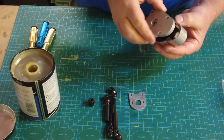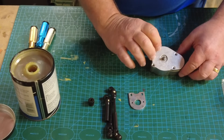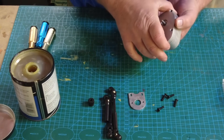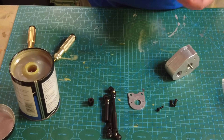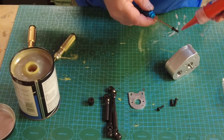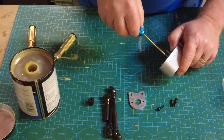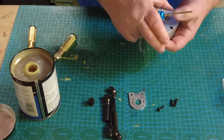I'll pop the plate back into position - there's only one way it goes on, countersunk holes on this side. This gets fixed together with countersunk fixings from the option pack bag. I'm going to put thread locker on these because I don't want them coming undone. If you are using thread locker and you're worried you may need to undo a fixing, you can always get a hot air gun on it and it will release relatively easily without damaging the fixing.